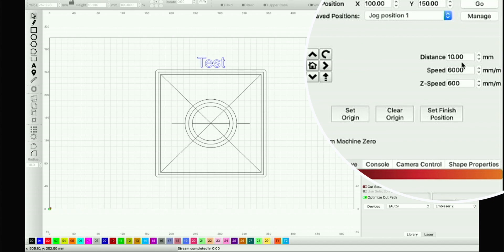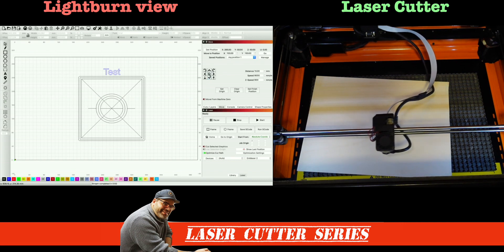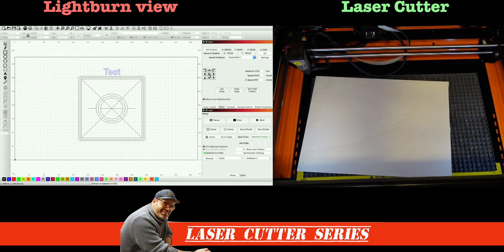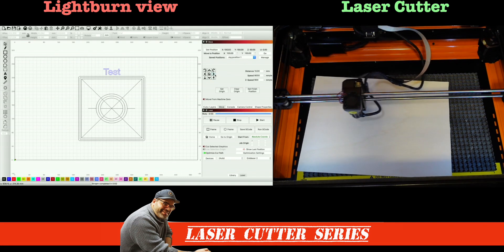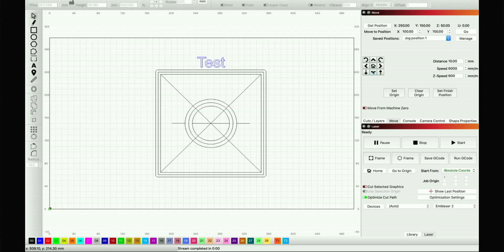I'm assuming from the look of it the big step is around 50mm. If your laser head is homed and you want to move down quickly, just hold down the Shift key and move your laser head as far as you want. I'll home it again and show you how to get it to move very quickly with Shift — I can get it approximately to the same area much faster than moving it 10mm at a time. If you're doing a print and cut, or have a piece of material needing a finishing pass, and need the laser head in an exact position before starting your job, this is how to do it.